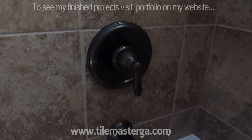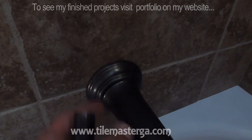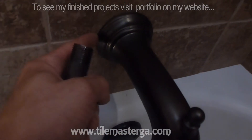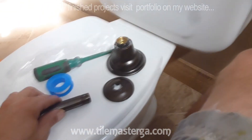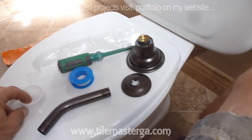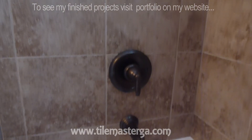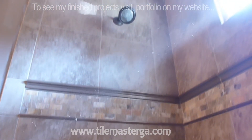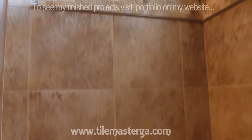Those two fixtures are already in place. You can put either matching grout color caulking or silicone to seal this, because there are always some small gaps and water may eventually get behind the faucet — so a little silicone or caulking around the faucet is recommended. The last piece is the shower head, which is fairly simple: we put teflon tape on the threaded fittings, we have a trim piece, and we have the shower head. All fixtures and the shower head are in place — this is how the setup is done for a regular tub, and it's now ready to be used.